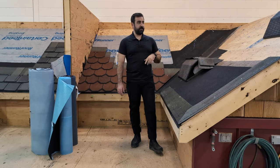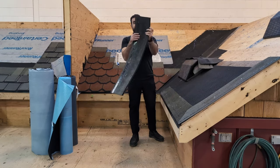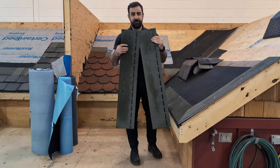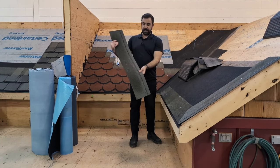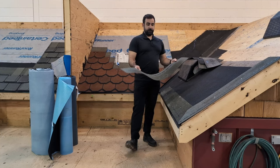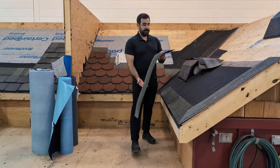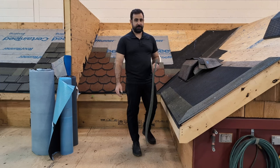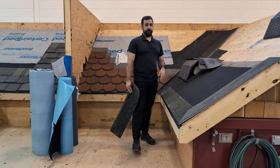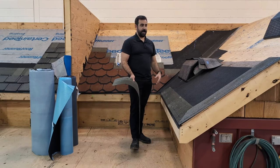So we've got our drip edge, ice and water shield, and then we have our starter shingles. Each manufacturer makes it a little easier for us now — they generally come in a sheet, perforated down the middle with two pieces, so you tear those up and you're given two separate pieces of starter shingles. This is CertainTeed Swift Start. Just a little side note: I'm in no way, shape, or form affiliated, sponsored, nor do I work for CertainTeed — it's just what we have on hand. It's a product I like to teach our apprentices on. Personal preference, I enjoy working with CertainTeed products. You can look up some other roofing gurus if you want and get some reviews on other ones, but this is just what I have on hand here in the shop.